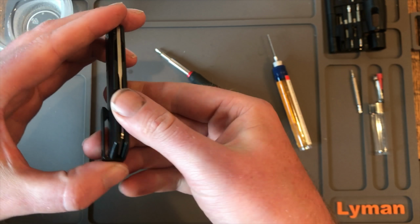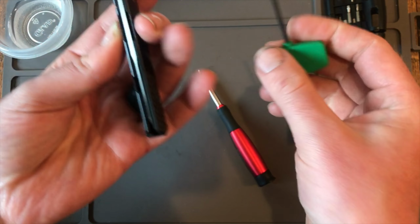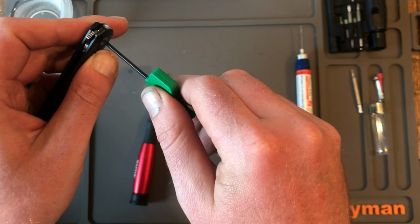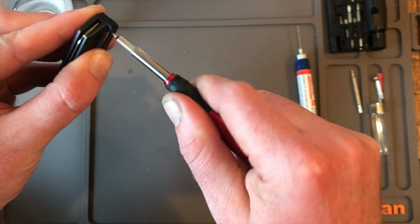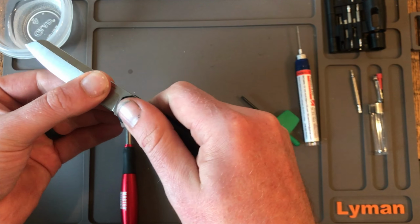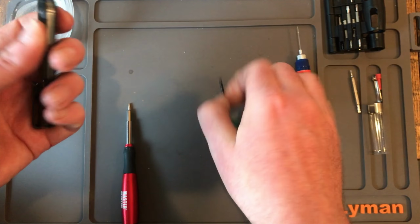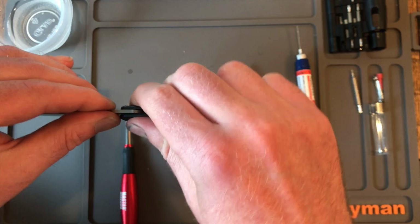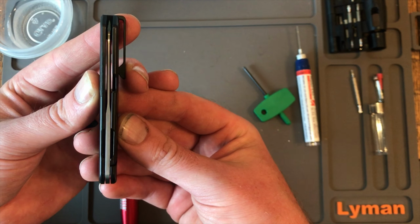I feel my centering's off just a little bit. Really close. More snug. Loosen it a little bit. Blade play, oh no. Nice. A little on the tight side. There we go. No blade play, up and down, side to side. All shut. Centering is near perfection now.